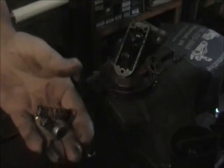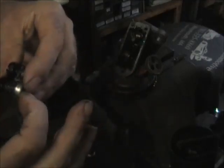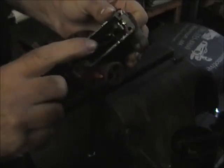Now I've got to pick up all these pieces — I'll be right back. There's all the stuff that went flying. You've got two different light springs depending on the year of the engine or the year of the vehicle. What I like to do is put the lighter of the two over the return spring. This one here is for the arm return, and this one here is obviously for the diaphragm. Now yours might come apart differently — it doesn't really matter, it could go either way.